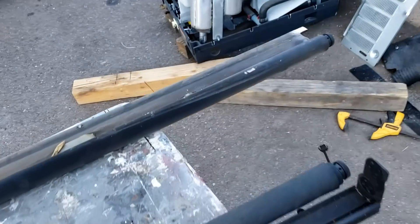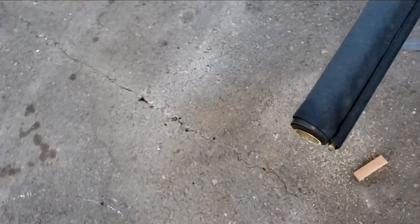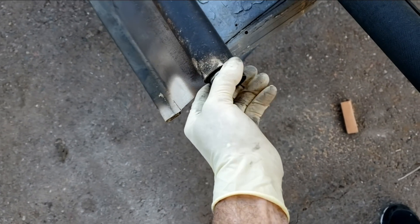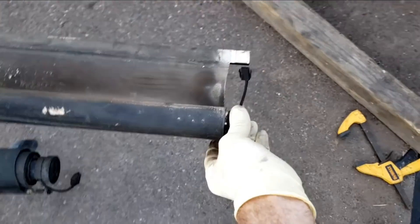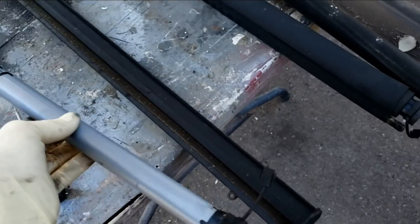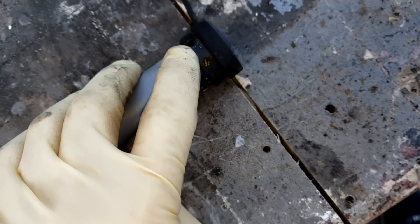That's been separated now — I definitely want this, I just have to clean it up a bit and see what I can salvage from the other ones. These are MCD shades — they have a spring in them. On this side is going to be the tubular motor, and that should just come out. These are good as gold so never throw them away if they're good, because for some odd reason these motors like to go bad. These ones you have to program — they have adjustable up and down stops on them.